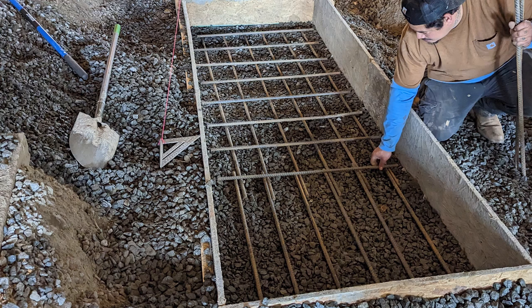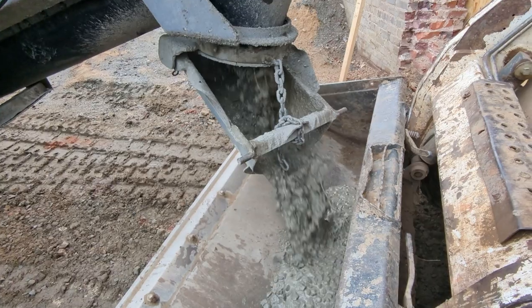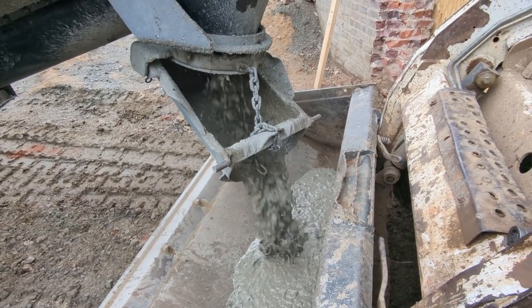And then, just like all the other ones, Arturo built the footing. This is a giant footing that we had to put here because it's holding 3 posts. A bunch of rebar in it. That thing's not going anywhere. And it's sitting on good 57 stone, wash stone. Once he had that dug up, a concrete truck comes in.